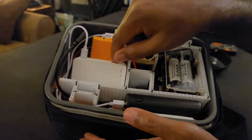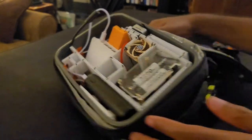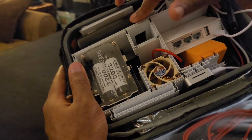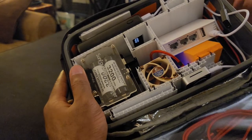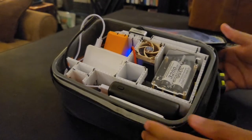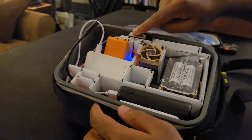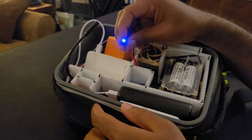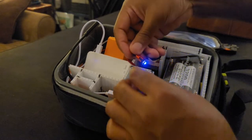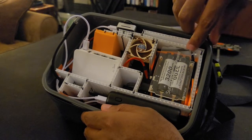I have a little orange block holding up the router so I can get easier access to the Ethernet connections if needed. There's also a small window cut into the divider — that lets me turn on the power bank and see how much charge it has. Currently the power cable coming from the Raspberry Pi 4 loops through that window. The current configuration is that the power bank is powering the Raspberry Pi Zero 2 W and the router, while the magnetic USB-C cable is connected to the power bank but disconnected from the Pi 4 at the moment.